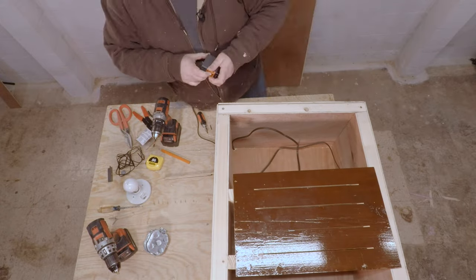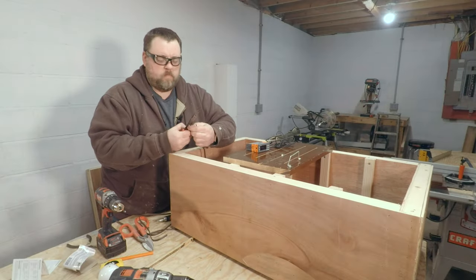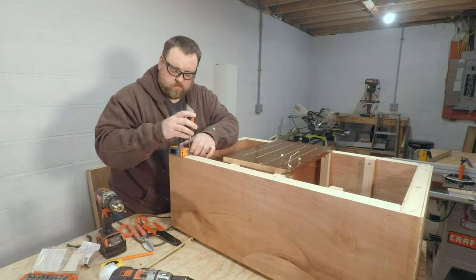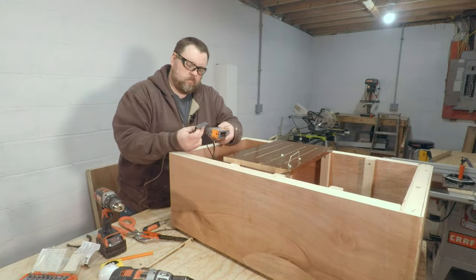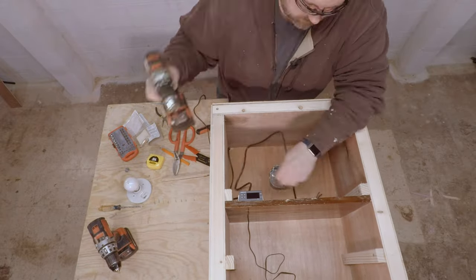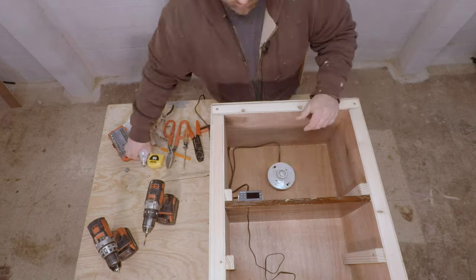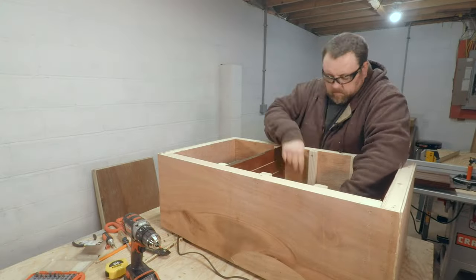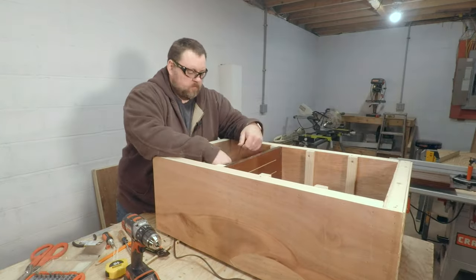You can see I still have the 1/8 inch holes in the shelf — that's because I haven't done any testing yet; later in the video you'll see how I enlarge those to a half inch. I'm wiring up the temperature controller — it basically works like a glorified light switch. You cut the hot wire of your light and run it through the temperature sensor, but the temperature sensor also needs its own power. You'll want to check the directions on that if you go to install this, because I'm definitely not an electrician. Once the temperature controller is all wired up, I install it on the bottom shelf and wire up the light fixture. I set the temperature controller to 75 plus or minus three degrees Fahrenheit, and ran the temperature sensor up to the top of the cabinet — with the sensor at the top, I can ensure the whole cabinet is hitting 75 degrees.